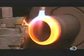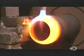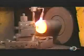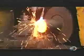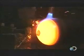In this way, the machine gradually closes off the top end and shapes 2 rounded areas called the shoulder and neck. Making these areas curved is the best way to contain pressurized gases. Curves spread out the stress on the metal. A sharp corner would focus the stress in one spot. The only exit for gases will be through a valve at the top.